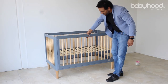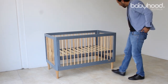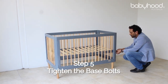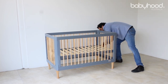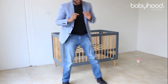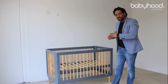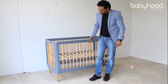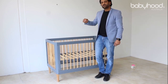At that point, you just need to raise the drop side. Now the drop side is fully installed. What you need to do now is hand-tighten those loose bolts. At this point, you can make sure all your bolts are tightened on the cot, because now your cot is completely assembled. Now you can test the drop side — do not test it until you've tightened your bolts, because it could come off. Now you're ready to try it. Here at the bottom, in your hand — lift, push, drop side down. As you can see, fully assembled.